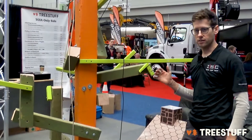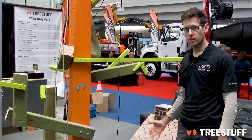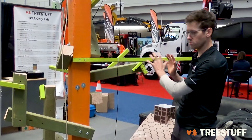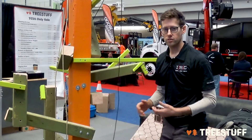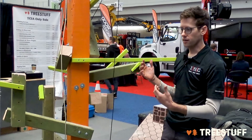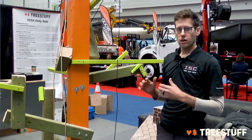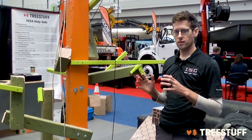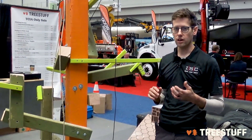Not necessarily something where I can bring this down right next to the house — maybe there's a fence, there are other obstacles that I need to get this debris way over here. There are other techniques that have been talked about before with using speed line rigging or double-whip tackle, but I'm trying to approach this from a more basic rigging concept with equipment that more than likely you already have on your truck.